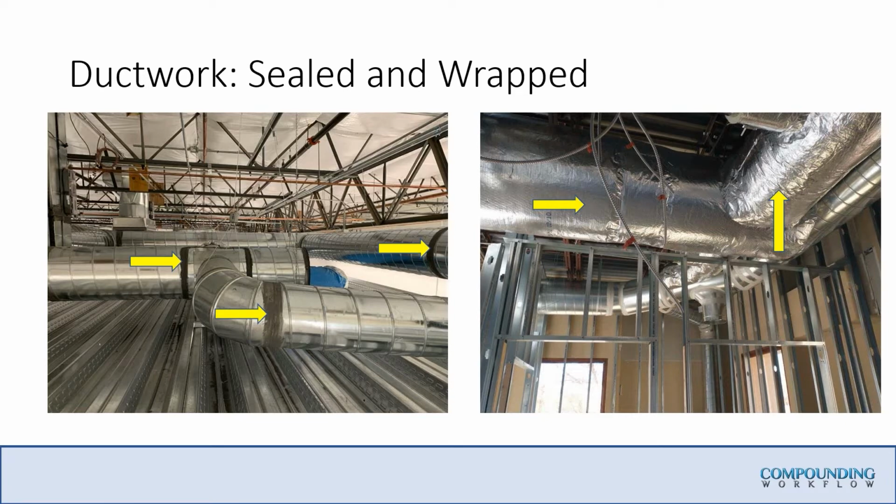So I say this not that it needs to be said, but it really kind of does need to be said, if I can contradict myself. So notice this metal ductwork, and we used to call this pookie back in the day, but now it's called mastic or duct sealant. HVAC guys still know what I mean when I say pookie. And then we're going to take it to the next step, which is actually insulating it and wrapping it.